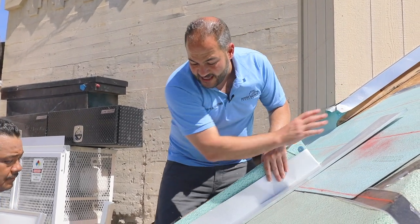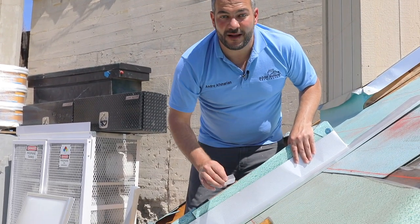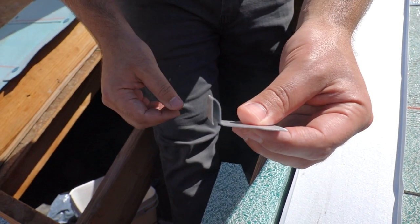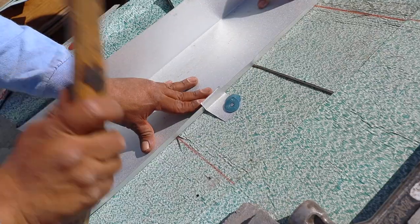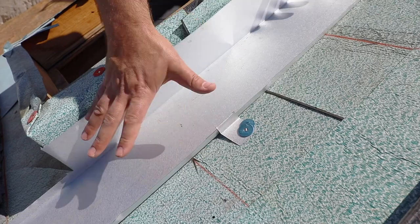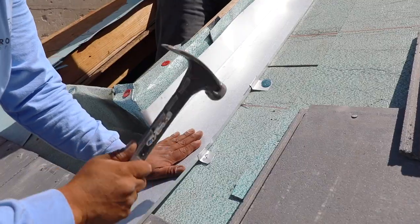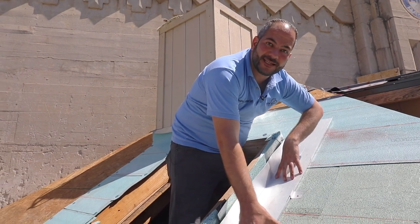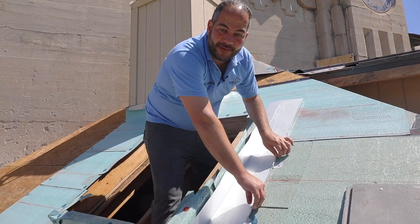One thing you want to make sure is you don't have any nails in this channel. We fabricate these clips in order to install this tile pan down. This clip is a field-fabricated clip — you can use really any metal that is similar to your tile pan, so if you're using galvanized tile pan, use galvanized clips. This holds it down tight enough so it doesn't shift, but it doesn't make any holes in the tile pan. Generally we like to install these clips every 12 to 16 inches on center. The tile will hold it down as well, but this just helps keep it in place during installation.